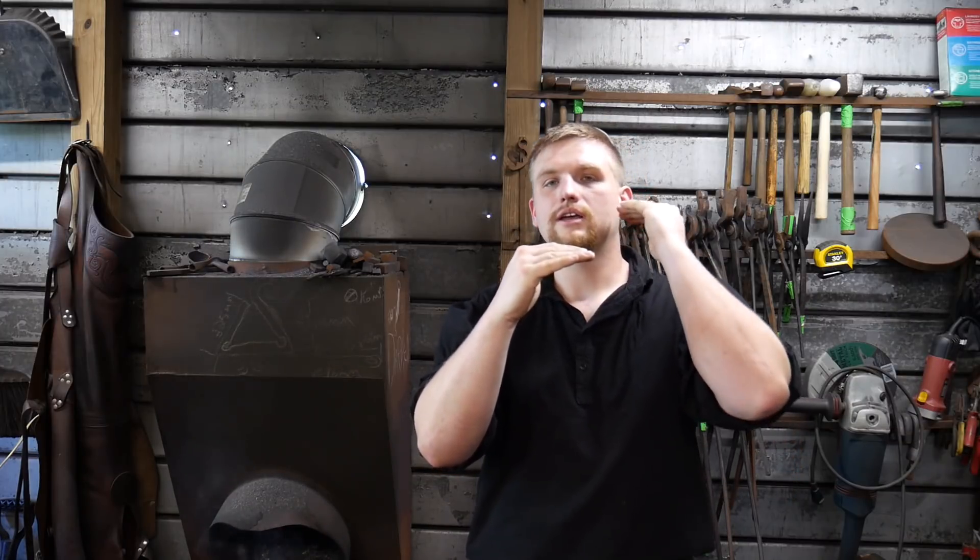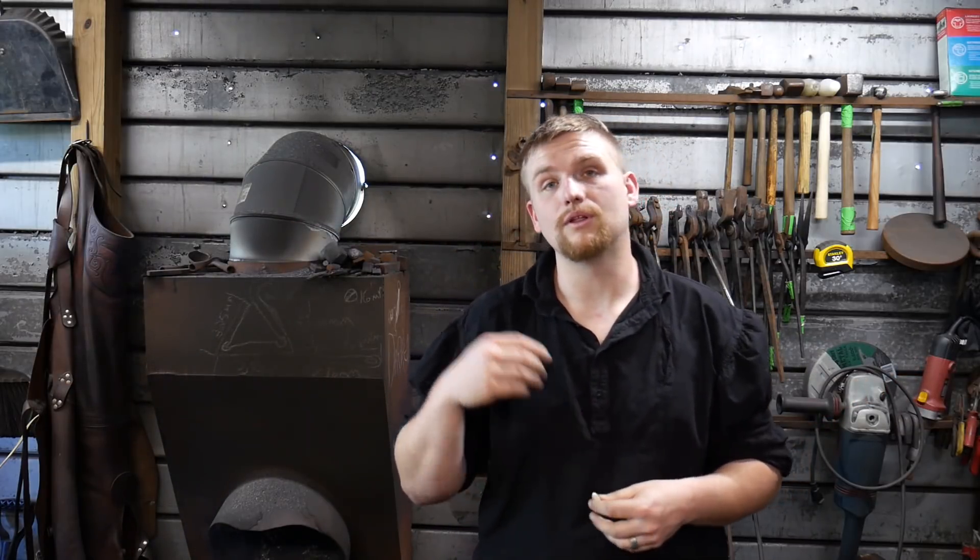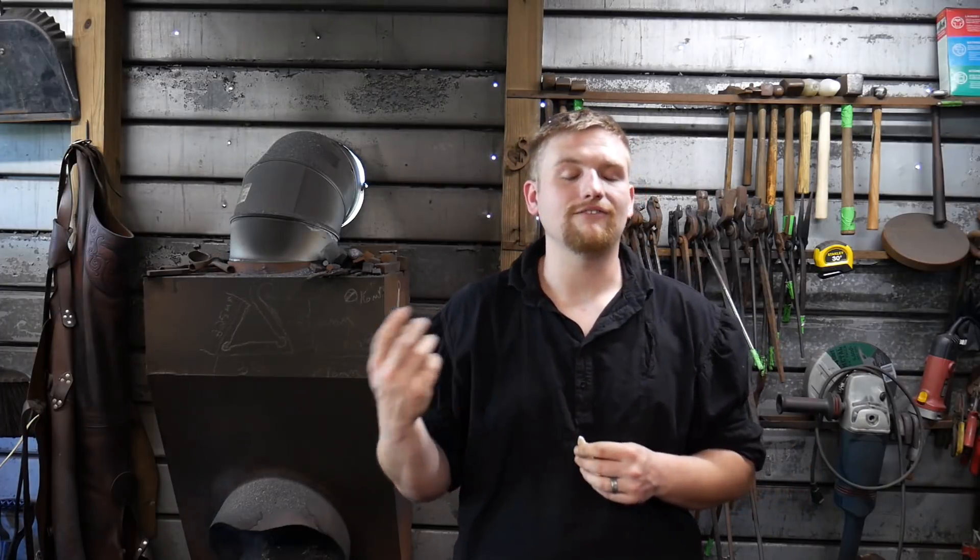The whole subject of hardening is more like a range than a simple list of hard versus soft. It's more like a flow chart — it has an apex, a peak hardness, and then you can go past it into the brittle state, or go below it to where you don't reach full hardness. Basically you have to temper the tool for what you're working with. If you're making chasing tools or anything cutting cold material, get it as hard as you can, then back-draw the temper to about a light straw — or as far as bronze — and you'll be okay.